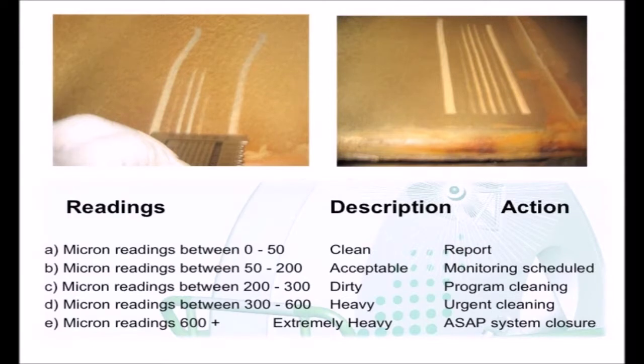The accuracy of the WFTT gauge will be defined by a reputable manufacturer and will typically be better than plus or minus 5 microns. It's most important to ensure that any gauge is held strictly perpendicular to the substrate, since holding the gauge at an angle other than 90 degrees will tend to exaggerate the measured result.